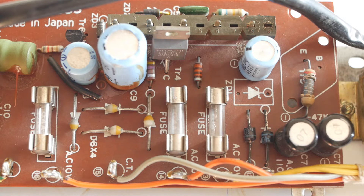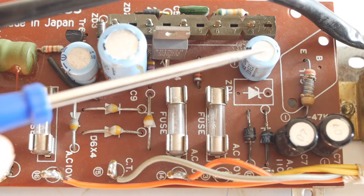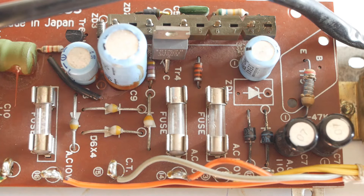So something has been drawing too much current. It could be a fault on the main board, or it could be as simple as a dodgy capacitor on this board that's acting more like a resistor. If so, it'll be this one. So I'll pluck out a few components and test them to see what we can find.